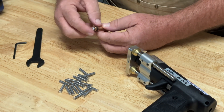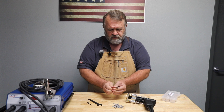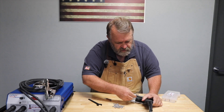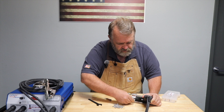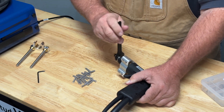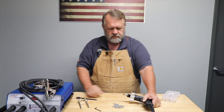I want about one to two millimeters to stick out. I'll make sure my backstop is firmly against the stud itself and cinch that little nut down. Then I'm going to loosen up the set screws on the legs and remove the foot piece and leg assembly. I insert this into the gun, take my 17 millimeter wrench, and snug it — but not overtighten, just snug it down.